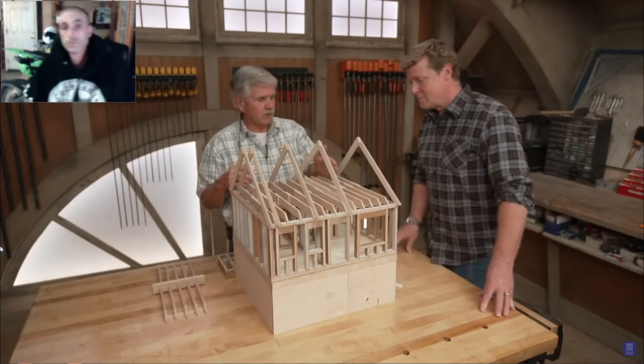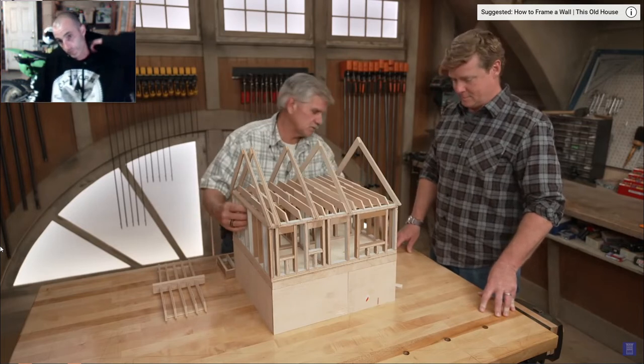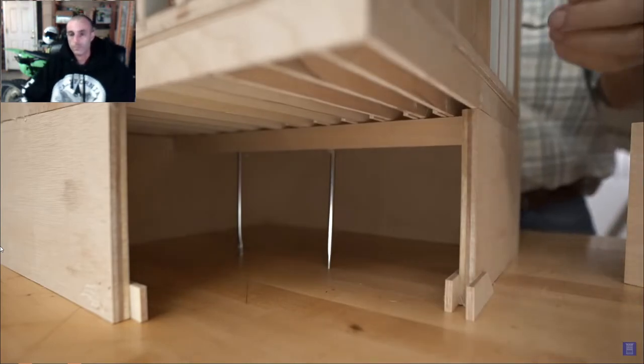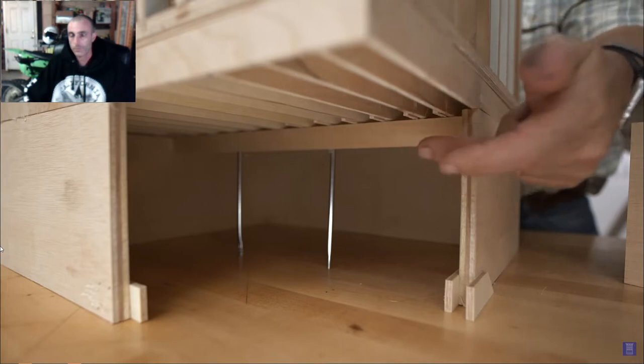All right, well, it starts with the direction of the bearing joist, all right? What's carrying the floor? Let's go down into the basement. So, let's open up the front wall. This here? Yeah. Look at you, this comes off. Right. So, now you get to look at the foundation, you get to look at the carrying beam right here and the joist resting on with lally columns in the middle.